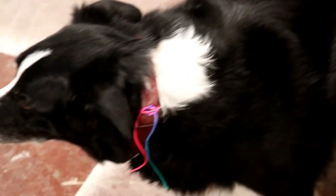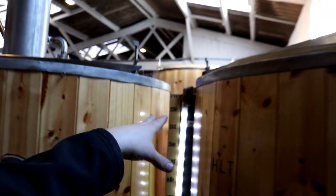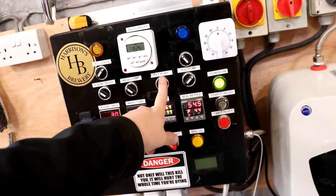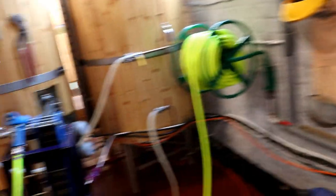Chance is wearing his colours in his hair — he's a little bit of a hippie today but he is ready to go home. He knows, he's not daft. Right, so we've just about got enough water in the HLT — we're past the mark there, so we've got at least 750 litres in there. We'll turn that off. We've got the recirculation pump on and we've got the HLT set to 77 degrees, HLT pump on, three phase on. We'll set it to auto — that'll come on at 7 o'clock in the morning.